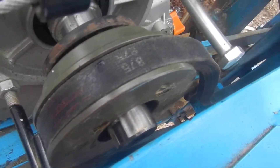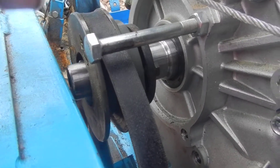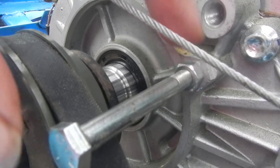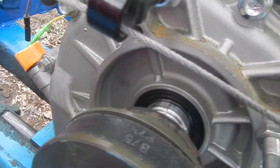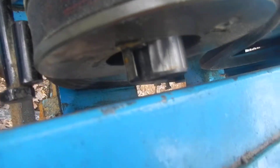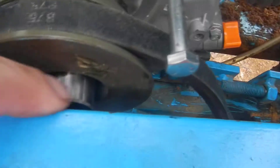You can also use it to see the rub mark — if I can get in there tight enough, there's a rub mark right here. When I took it off, I left the set nuts at the same position, so I just bolted this thing back on exactly the way it was. I was able to align the pulley in approximately the same place as before. I took off a half an inch of that shaft — you can see there's still a little extra room, but you want to make sure you've got a quarter of an inch clearance so that shaft isn't rubbing a hole in your guard.